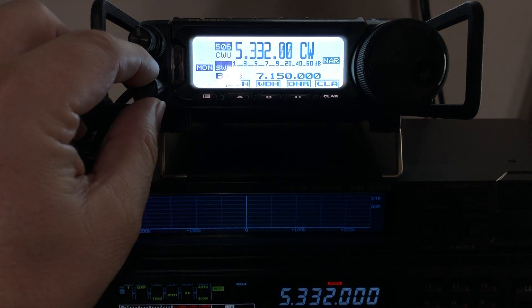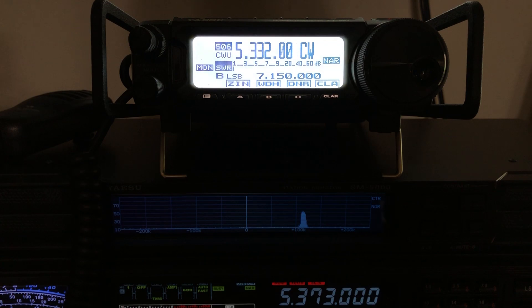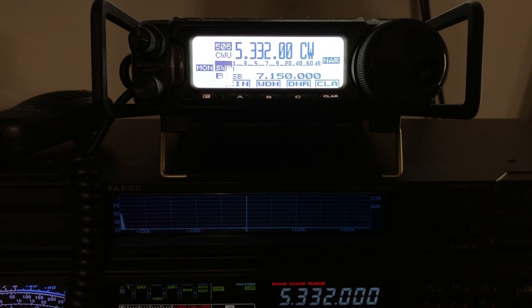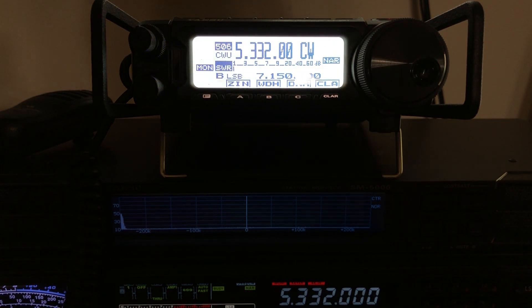Now let me show you what I did with my FT-891. The FT-891 ships from Yaesu just like you see on my FT-5000 down there. This is channel 1 sideband — it displays 5.332 on the FT-5000, whether you're on channel 1 or channel 6. But internally in the radio, Yaesu pre-programmed it so that even though it says 5.332 — there's some NTIA verbiage requiring the radio display the center channel frequency — they're actually making the radio transmit on 5330.5.